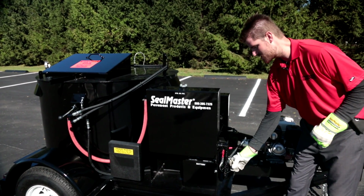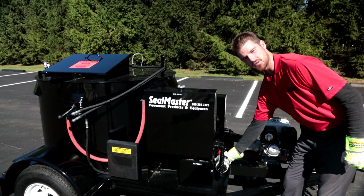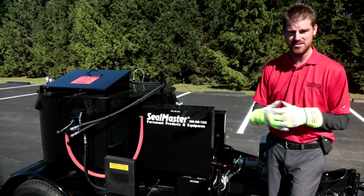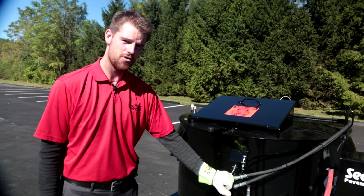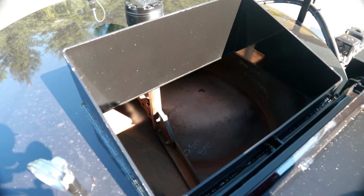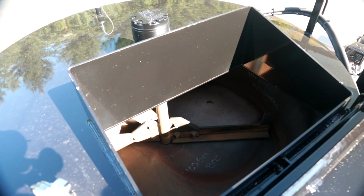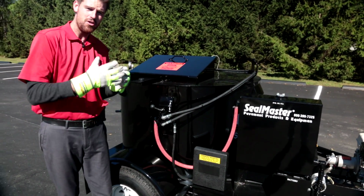Here we have our master shutoff on and off valve for the hydraulic system. This is our hydraulic filter element, which is on the suction side. Again, our hydraulic pump, and all we're driving with hydraulics on this unit is our full sweep agitation. Bolted on the side of this machine is our control valve for the full sweep agitator. Obviously we have forward and reverse function, and as we mentioned to you before, the hydraulic motor that directly drives the agitator is bolted here on top of the unit.